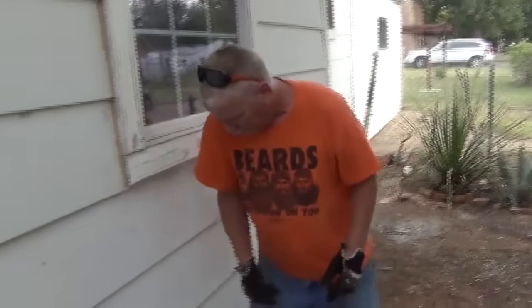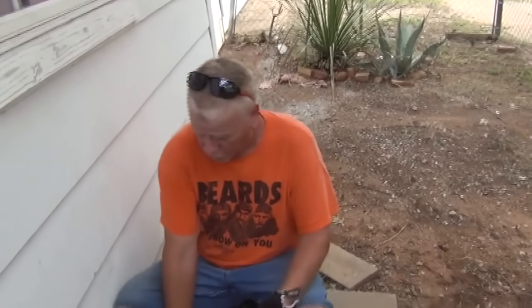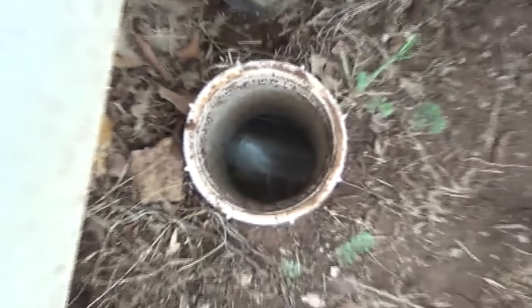All right, what are our symptoms? Washer's backed up, toilet's backed up, toilet runs into the tub. Nothing in the house will leave because it all comes through this opening right here. And you see, I've got water running in the house and it's starting to fill up this line right now. As we've been standing here, this water has been rising. Let's just let it rise up a little bit until we get it to the top.